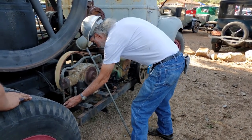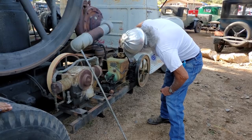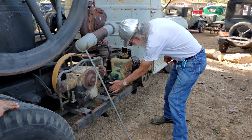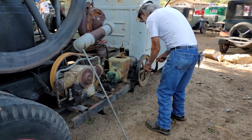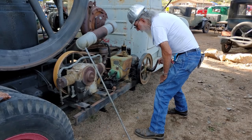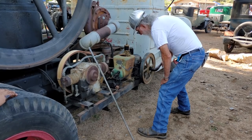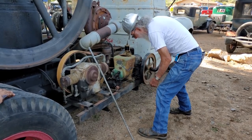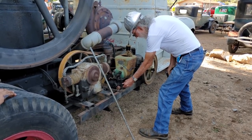Many times it will start and run on the first try. This is relieving the outlet on the compressor so that you're not pumping against head pressure until the engine warms up, and adjusting the drip oiler on the piston. How much pressure do you need in the tanks to start the big one? It will start on about 35 pounds; I usually have the relief set at about 60. Sometimes it will take off and run the first time, and other times it just doesn't quite want to.